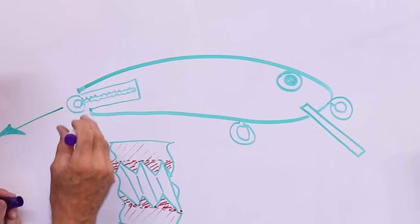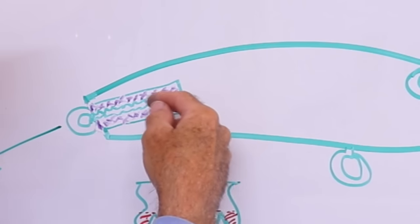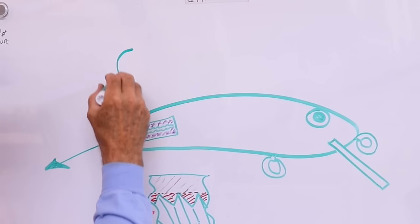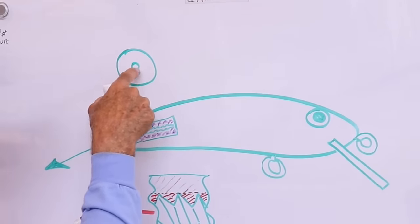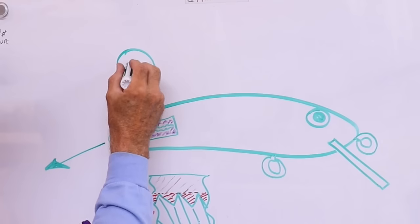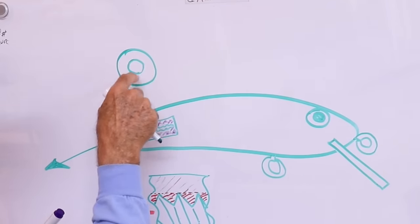And by using two-part epoxy glue, you end up with a larger cylinder of glue and a much bigger contact area. Because if this is the tail, and let's say you drill a hole just big enough for the screw to fit in and then glue it in, that is the surface area you have for the adhesion and the strength in shear. But if you make that hole slightly larger, that surface area increases quickly with the change in radius.